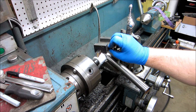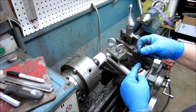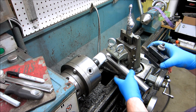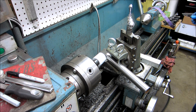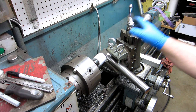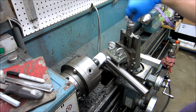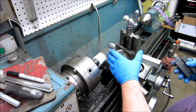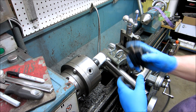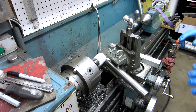This is a normal tool holder for the quick-change post I had on there. It dawned on me after the fact that if I make a jaw that I can clamp the tubing into — with the bar sticking on the side that I can clamp into this — I can just get another tool holder and have my tubing holder mounted in the quick-change. That would make it so much easier, because it's kind of a pain to take the compound off and put this thing on. The biggest difference is that this has a lot of room — I can easily go down far enough, push the tube in, and notch across the top to have a saddle mount for a two-inch piece of tubing. I can't do that with this. I could raise it up and down in the tool holder to get perfectly centered or a little off-center, but not anywhere close to the kind of adjustment I can do with this.